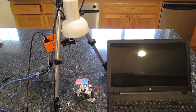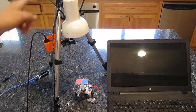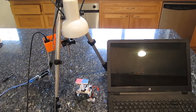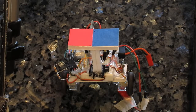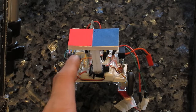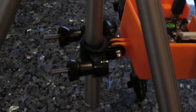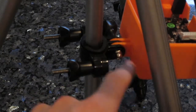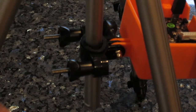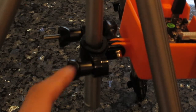So what you'll need for this project is a computer, a little rover, an Arduino Uno, a Pixy cam, and some sort of light source in case you're working in low light levels. The robot I'm using is the same rover that I made in a previous video, with the only difference being that I taped two different colors of tape on there — I'll explain why in a minute. To connect the Pixy cam to the tripod, I 3D printed a case which I found on Thingiverse, which had a GoPro adapter on it, and then I used a bicycle adapter for the GoPro to clamp the Pixy cam onto the tripod.